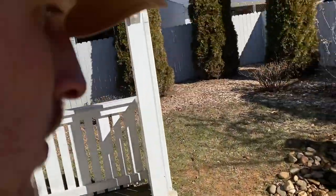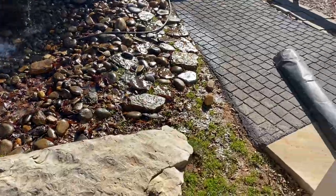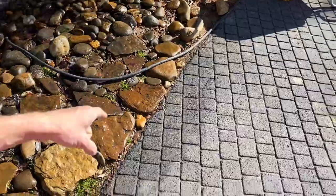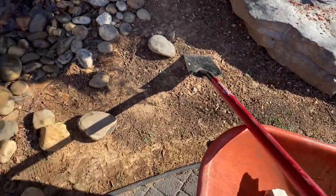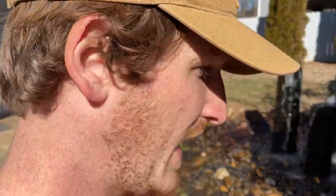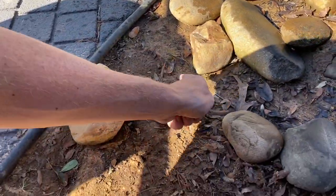The plan is we're going to go from there to the corner, with rock coming around here, around the big rock. I'm going to pull these ones out and use them on the ends, coming through all the way up to the big rock. We'll put smaller rocks in between, and anything extra won't go to waste. First thing I'm going to do is use this Wolverine shovel — one of my favorites, very heavy duty — to cut along this edge and level it out so the stones lay right.